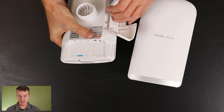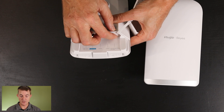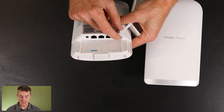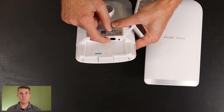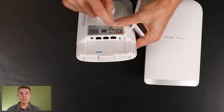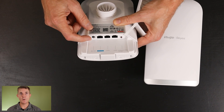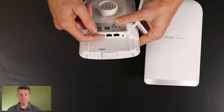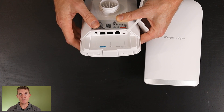Let's take this off so we can have another look inside. As you can see, the cable comes quite a long way up inside. We've got our reset button up in here. We've got our two ethernet ports — these are not PoE, they don't give out PoE, but we've got two that we can loop out to other pieces of equipment. We've got our 12-volt DC over here and our PoE port for input, which could be 24-volt or 48-volt.